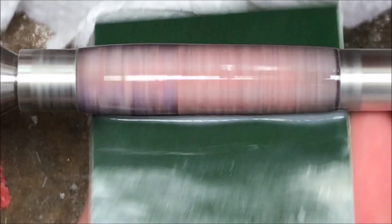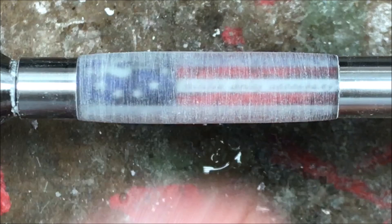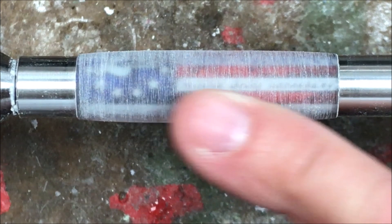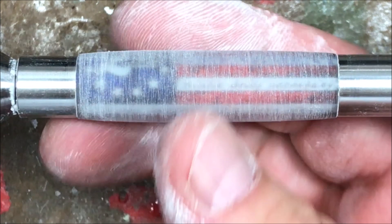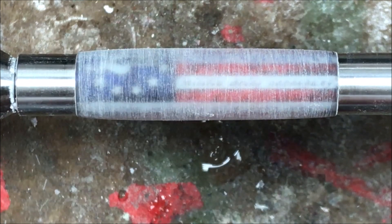I'm going to be completely honest with you. You'll notice the scratches in the blank — I didn't like what I was seeing. There was a little hump right here, the blank wasn't nice and smooth all the way down the middle, and there's also just a tiny fingernail of a lip at the bushing. So I went to some 120-grit sandpaper and I've been sanding the blank, dipping the sandpaper in water, and I'm going to work my way down through 600, then go back through the micro-mesh pads. I could have made a final cut to clean that up, but I'll be honest — on the blank I had on the lathe before this one, I came off the end of the blank and caught my tool on the bushing, which tore up about half an inch of a beautiful blank. So I'm a little gun-shy right now — pardon the pun since this is a bolt action. I think using sandpaper is the right move at this time.